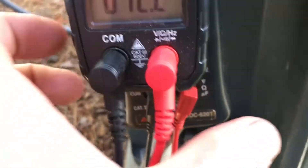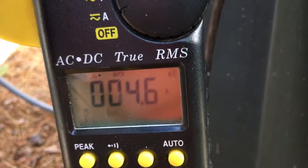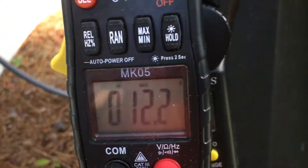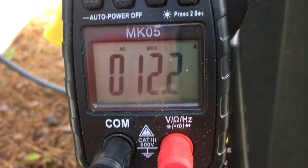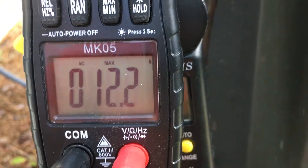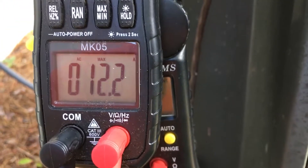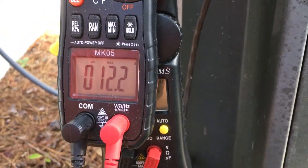Right there on one meter it's down to 12 amps — the other meter doesn't appear to have fully grabbed it. I believe the black meter is more accurate at picking up the inrush, so we went from 40 down to 12 amps, which is very impressive. If you take 12 times 240 volts you can see we've greatly reduced the incoming wattage needed on a generator to start this thing up. That's start one of five — maybe it'll get down to 10 or something, but absolutely incredible how much it reduced.